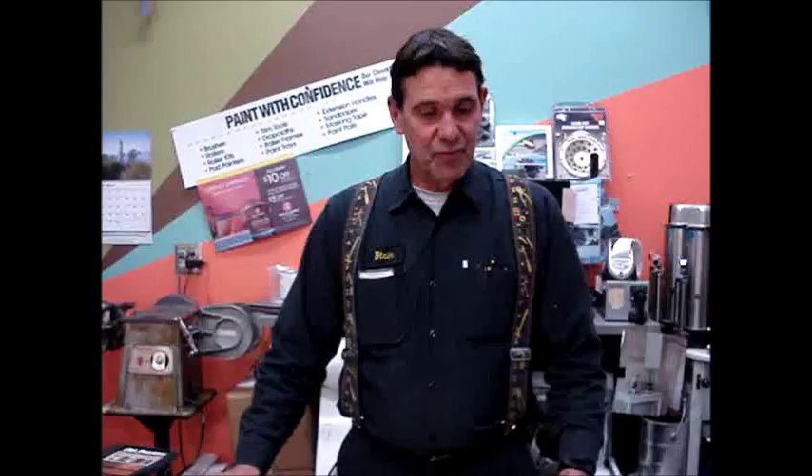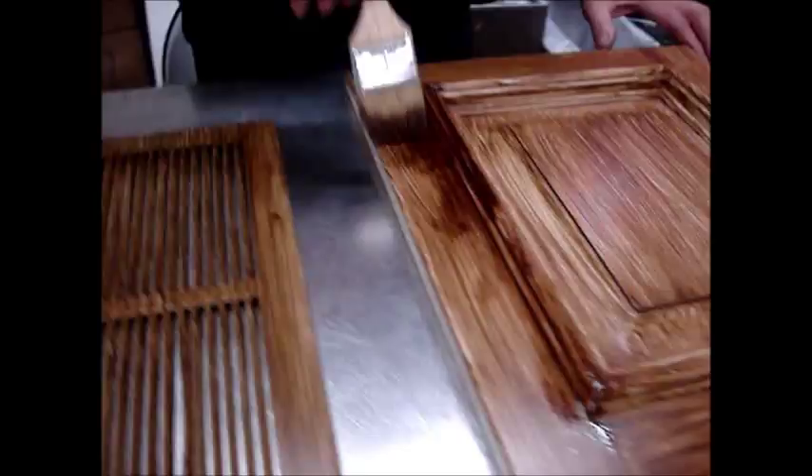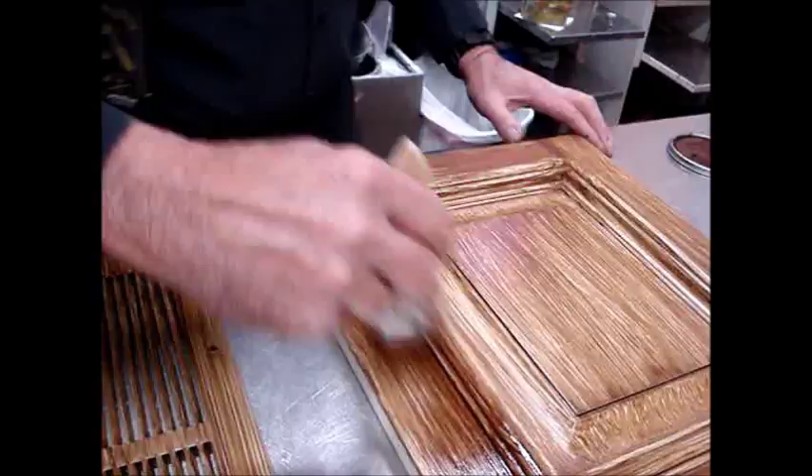You can put a satin varnish over the top of this to protect it. We let our project sit for one day, but there's an awful lot of white — the ivory has bled through. Our goal here is to cover the ivory and get more grain, because the first brushing put a certain grain on the door. Now when we do step two, if you need it, we're getting a little more grain on top of the first grain, so the grain gets a little more complex.